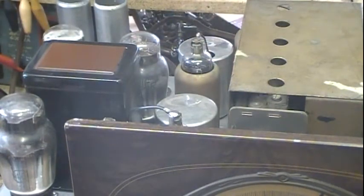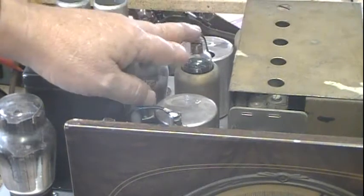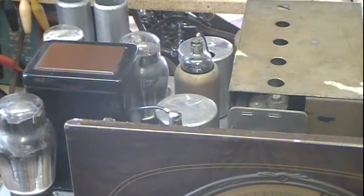They were dead — not even the slightest inkling. So I decided the next step. You can get the information either out of Nostalgia Air or there's an Atwater-Kent site. I got the voltage chart and I started checking voltages. When I got to the front end tubes — the IF and front end tubes — I found that I had no plate voltage whatsoever. At least nothing positive. There was a negative voltage there, about minus 2.5 volts, but that was all.